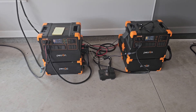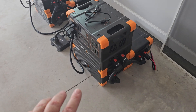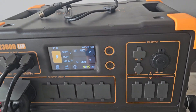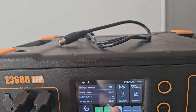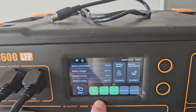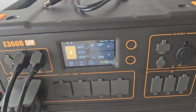Both power stations are doing fine. I did have an issue during the discharge and recharge on power station 2: battery zero had an incorrect percentage reading. The volts were exactly the same as the other batteries, but the percentage was reading off. Pulling up the app now, all batteries are showing 100%. Battery zero is at 55.4 volts, battery one is at 55.3, and the host is at 55.3 — it's reading correctly now.